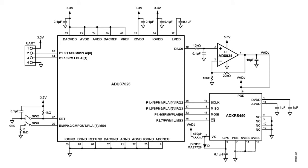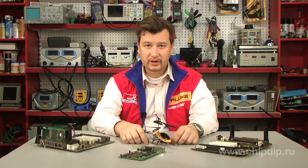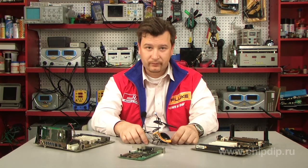Additional specifications include minus 40 to plus 105 degrees Celsius operation, 3.3 to 5 V supply voltage, and two package options: a 16-pin SOIC package and a 14-pin SMT-compatible ceramic package for vertical mounting.